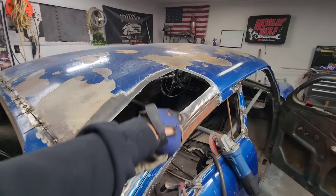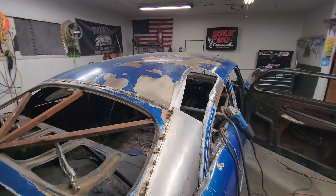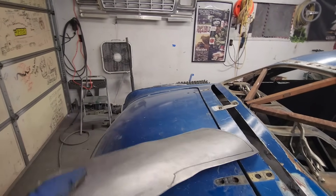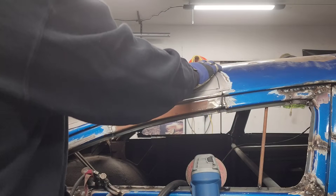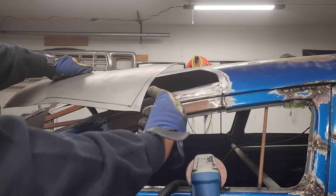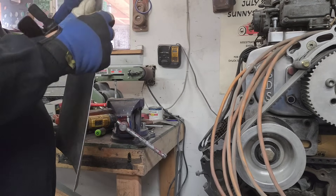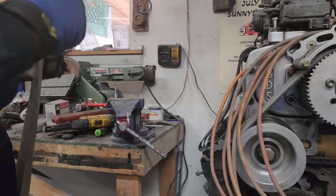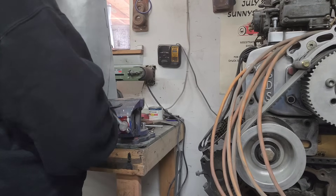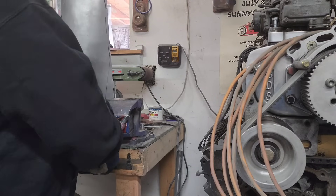Let's go ahead and move on up here. I just kind of rolled it how I did on the other one — I got to roll it this way too, that's going to be the hard part. Stick it up there and see what we get. I want to make this roll here a little closer to the edge — I feel like it's too far that way. I don't have a shrinker but you can use a vice as a shrinker — I've done it. I'm going to try and put a little bit of curve in it.